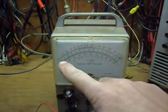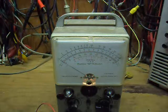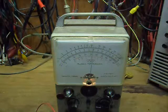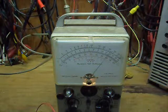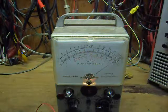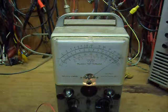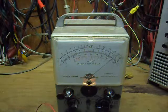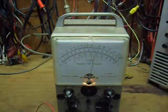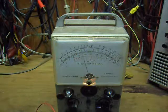The meter scale goes from 0 to 1.5 kV. When I turn on the power and slowly turn up the Variac, the voltage will slowly come up — depending on how fast I crank it — to the ultimate voltage in this case, including the voltage drop from the meter loading on the resistor, to about 1.45 kV or 1450 volts. When you turn the Variac back down, the voltage in the capacitor slowly drops back to 0.00 kV. Do not touch anything in the circuit until it has dropped back to essentially zero.